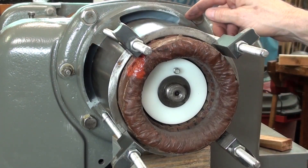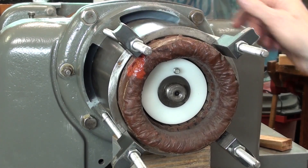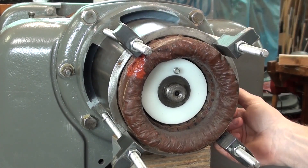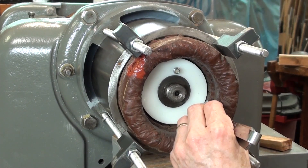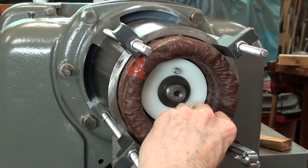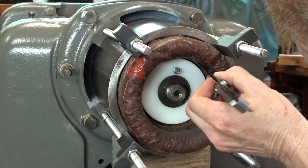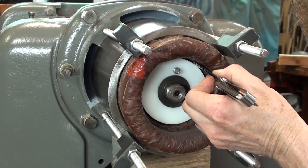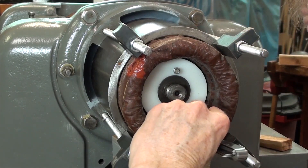I've been through about four iterations of grinding these touch points on these three spots. I did not grind the fourth one because that didn't need it. Now I'm getting 82 thousandths here and it's just fitting almost all the way around — just a tiny bit tight up here, but I'm going to call it good. It's pretty concentric, much better than when I started out.